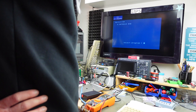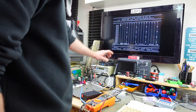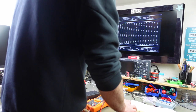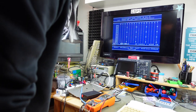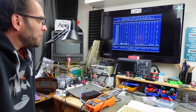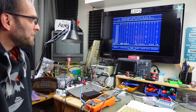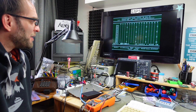We should have our Extended RAM Test again — it's showing me 16 banks at 256 kilobytes. Let's test all and see if we get a proper result. This is now with the switch in the grounded position. The extended RAM test only shows the extended memory — and we got errors. That's weird, but I got a lot fewer errors than previously.